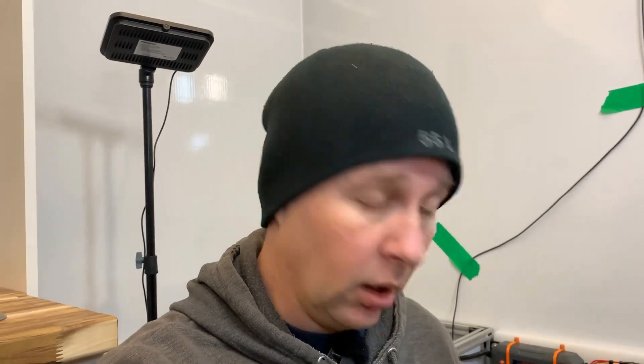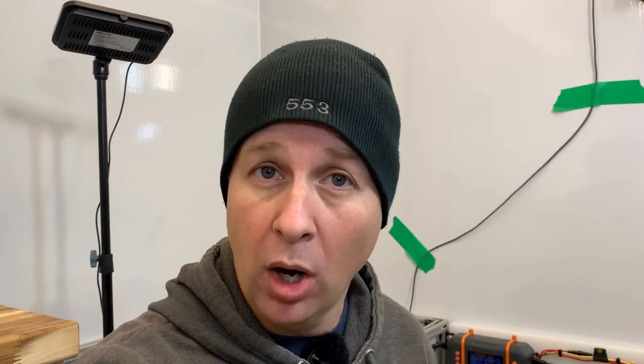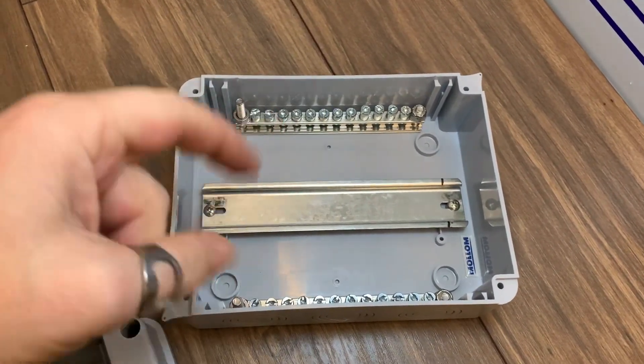The next is something that fewer people might pick up on — I have used a nylock nut to hold this bus bar in place. Generally, nylock is not something you want to use on any kind of current-carrying connector, because an electrical connection can heat up, and that heat can soften the nylon within the nylock nut and allow it to loosen off. But here's my perspective: if I've got heat coming to a nylock nut holding a bus bar into a plastic box, that's probably not my biggest worry — something has already gone horribly wrong. Making sure all connections are made well, tight, and clean will yield far greater results than worrying about a nut that can withstand excess heat, because I shouldn't have excess heat.